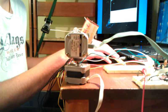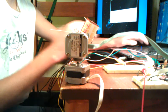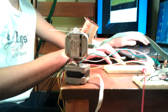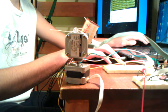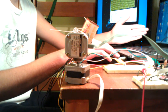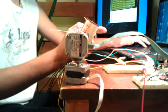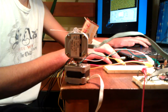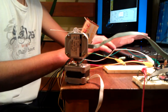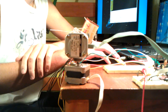and I'm able to transmit signals to the controller. So first of all, let's start off with 5. When I push the 5 on my keyboard, it sends a signal to the microcontroller, and I think it's 53 would be the actual number code for it. So it sends 53 in binary to the microcontroller. The microcontroller reads that, and based on the input of 5, it starts to send me back these values, and these values are the digital conversion of the analog signal of the 3 sensors. So you have sensor 1, sensor 2, and sensor 3.